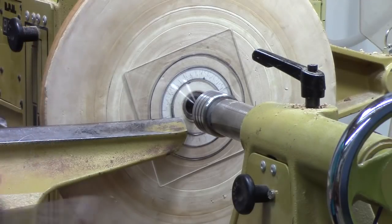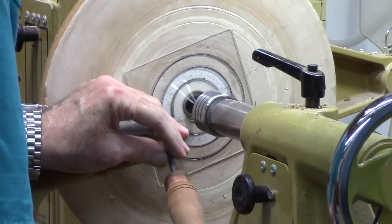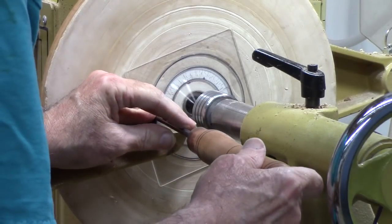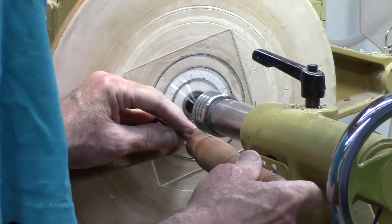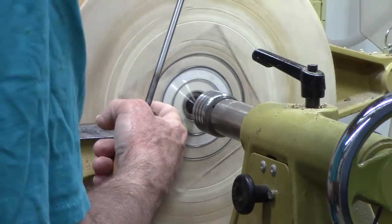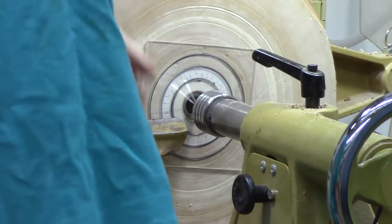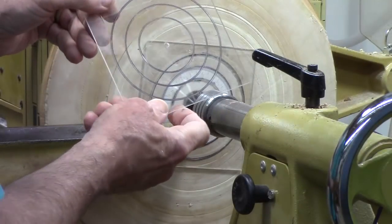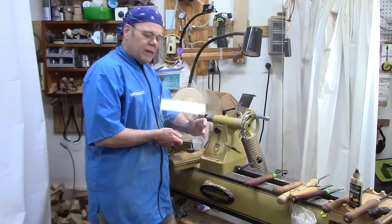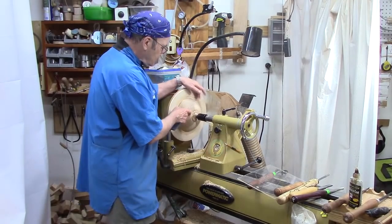On the lathe I marked the circle, then came back with my pyramid tool at just below a thousand RPM and scribed a little line. Then I went back with a magic marker or felt tip pen to put a little color in there, and now I've got this very handy center finder. Let me show you the kind of backer plate I was talking about.